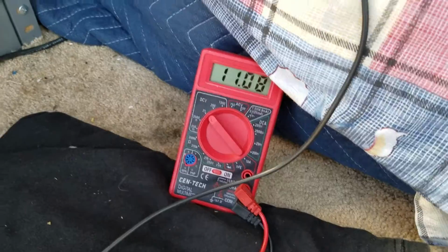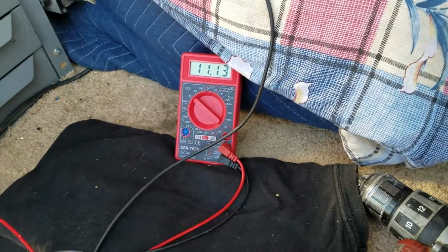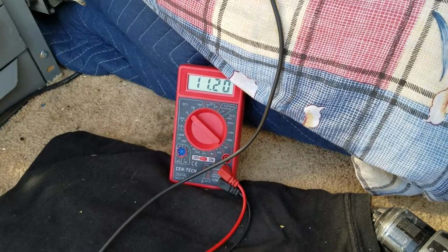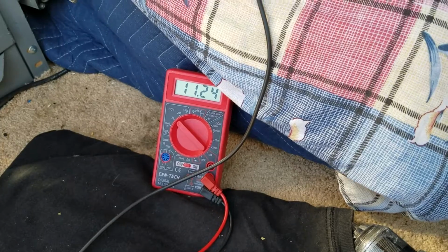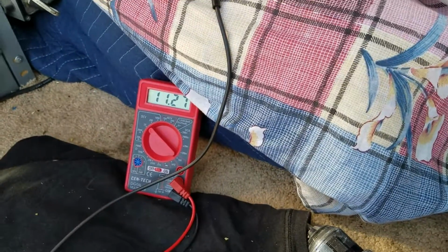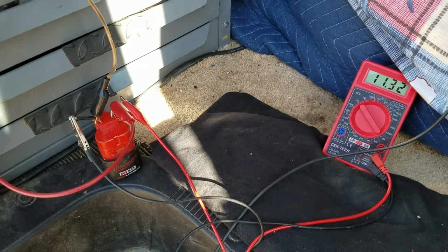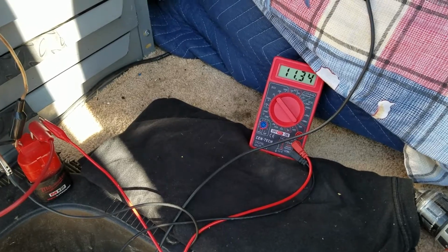It's going to jump up there really quick, but that's only for the primary charge. Once it gets up to 11.5, 11.9, it slows down, and it takes quite a while to go from there to the 13 volts is what I want to put into it to make sure that I've got a full charge. So anyway, as you can see, I can charge my batteries here, my cordless drill batteries, without using a charger.